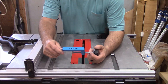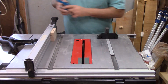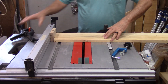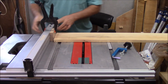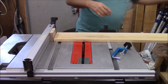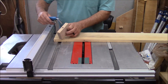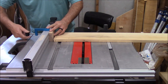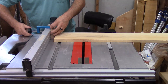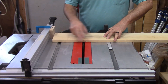The third little accessory is these fence clamps from Rockler. How many times when you're cutting on your table saw do you have to set a stop block up by the fence? We've all done it with a clamp. But this little accessory fits over the fence — you take a piece of wood, drill a hole the right size, set it in there, and then screw it to your fence wherever you need it, so you won't get bound up between your fence and your blade.